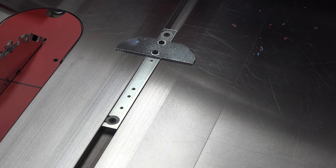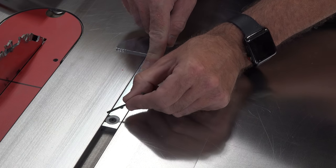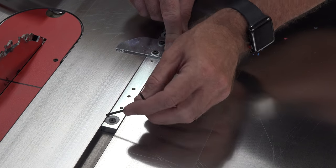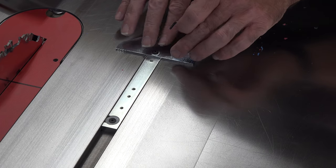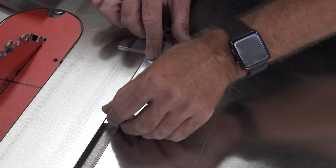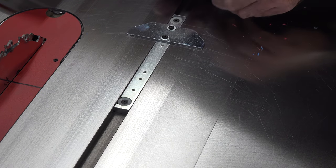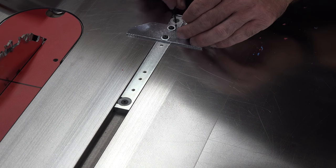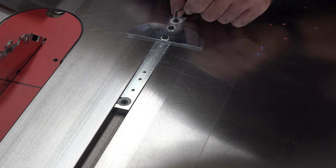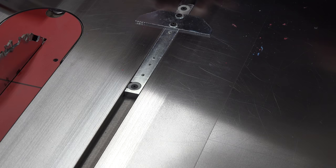For those who have never used an Incra device, they have these little plastic discs that go in with a set screw in the bar. Right now it's rather sloppy and loose. You place the provided allen key into the hole and tighten those rings — essentially shimming the bar out so it fits properly in the miter slot. Adjust until you get a good tight fit, then move on to the next step.